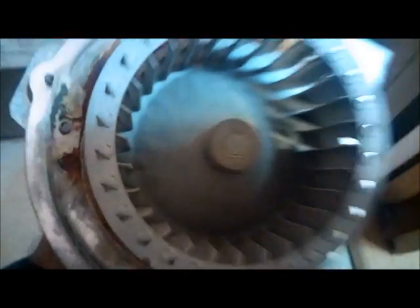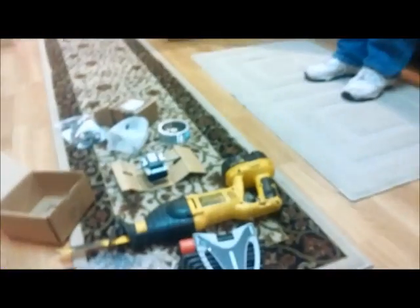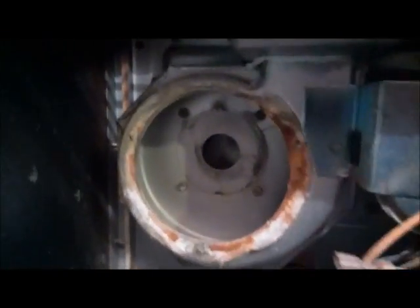So that was a simple one. In this particular model, we typically cut the shaft of the motor so you can get that set screw on there — which typically you're never going to get off — so we just cut the shaft on the motor. We got the new impeller wheel, and the motor is just going to go back in that plate that we need to mount it back up in there. The gasket's shot, so we're just going to use some high-temp silicone on there.